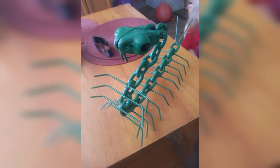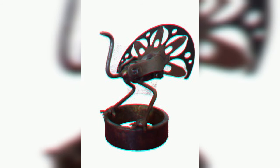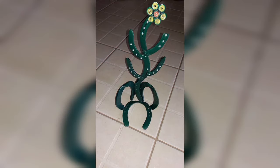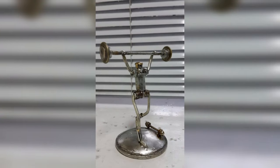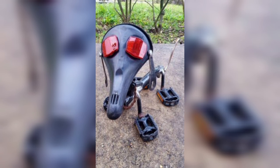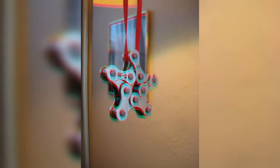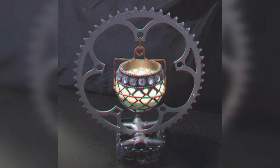Prepare your material: measure, cut and prepare your metal pieces before welding. Ensure they fit together properly and are clean of rust, paint and other contaminants. Welding settings: follow the recommendations in your welding machine manual for the appropriate settings, amperage and wire speed, based on the thickness and type of metal you are welding.